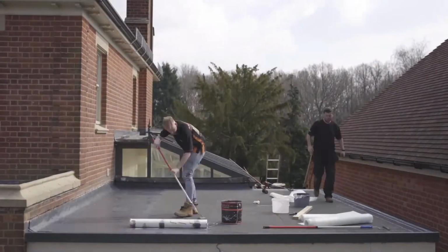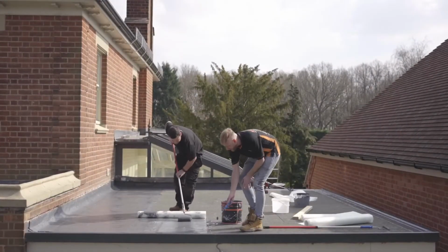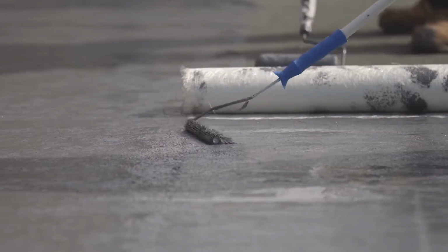Make sure you use the matting edge that is frayed and not the straight edge for your overlaps, otherwise you will see the line once it's cured.